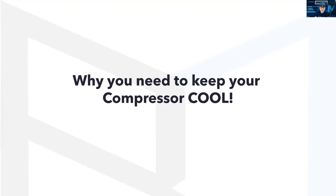Welcome to this compressor training. I'm your host Char Matthews, and I'm really excited to talk about this topic. I cover it in a lot of my programs, but I know I need to get more information out there about why it's so important to keep your compressor cool. With these new refrigerants coming out, they are starting to go back to the way R22 was. If you worked on any low temp R22 systems, you would have had some sort of cooling on those compressors because with that high compression ratio, R22 runs really hot.